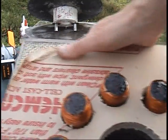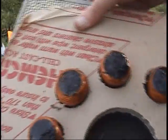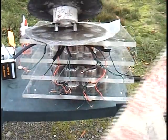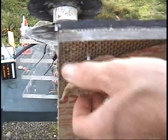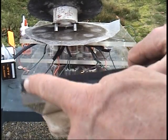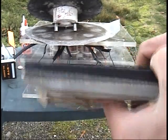Here's the end plates — the stator end plates — and I have four coils sticking out; I haven't glued them in yet. Just to show you how these are made, you don't necessarily have to do it like this, but that's how I'm doing it. It's half-inch acrylic plastic — this is the Starboard plastic. I really like this sort of plastic; it's really strong, easy to cut, and it's made for marine use.